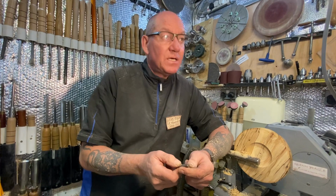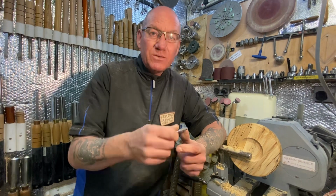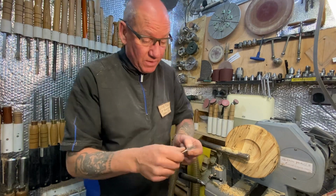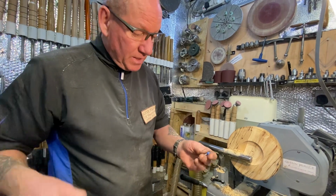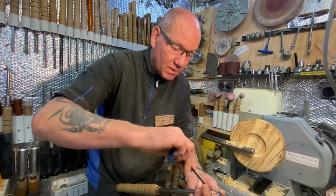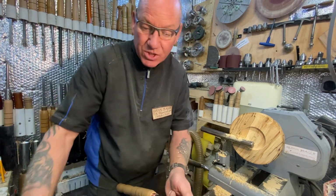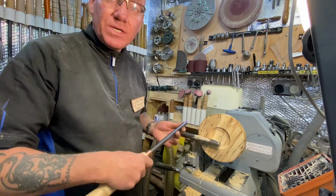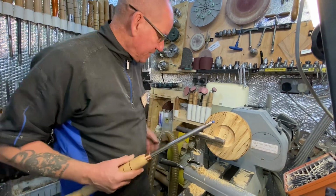Now, I don't know whether anyone's seen Axminster Tools, Colwyn, he was doing one the other week on thimbles, doing little thimbles, and they had a little scraper. Perfect. Goes up inside your little thimbles, does a scraping. It's carbide, lasts forever. Do that side, turn it over, you've got another clean cut that side. And you've got your round one, so if you want your round one, pop it in there, and again, you can use it for hollowing, use it for shaping. But obviously with a router bit, because the cutter's only on one side, you can only go one way. I mean, you could get a push on it, wouldn't be easy, but mainly for that way.